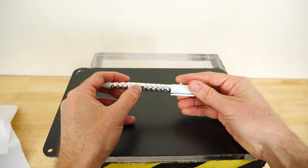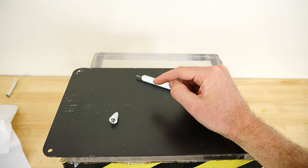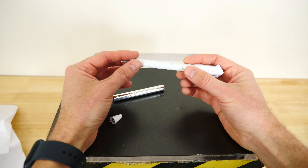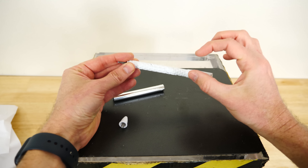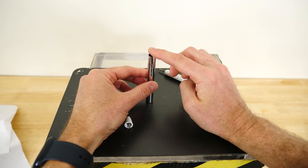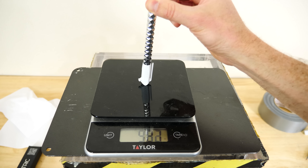Normally when you try to crush a cylinder like this it doesn't fold perfectly like we saw in the hydraulic press. A lot of that has to do with instability at the ends — the initial conditions of the crush. What the pen does is support it on all sides and give it specific locations where it's going to start buckling. The pieces on the pen initiate a pattern that propagates down, so you don't depend on luck for getting the initial pattern right. It also has stops so it can't go any further.